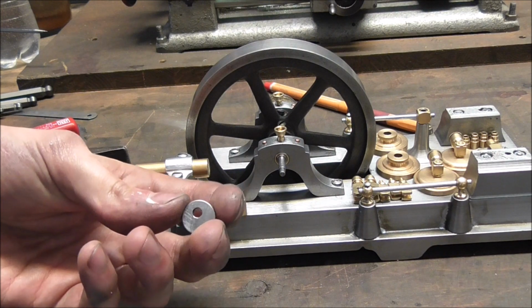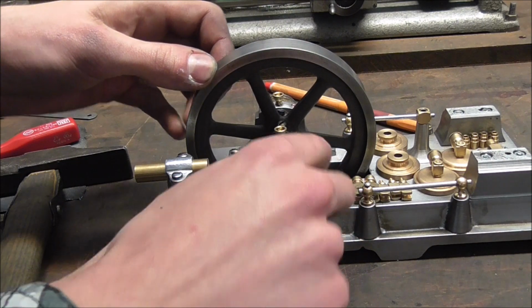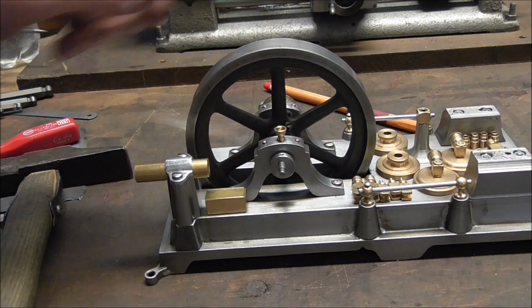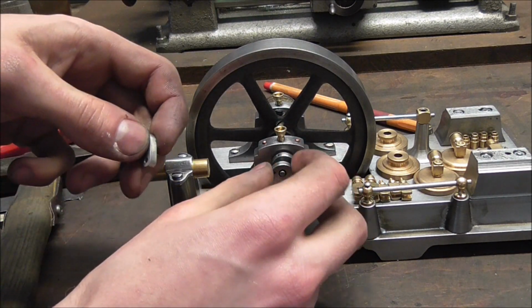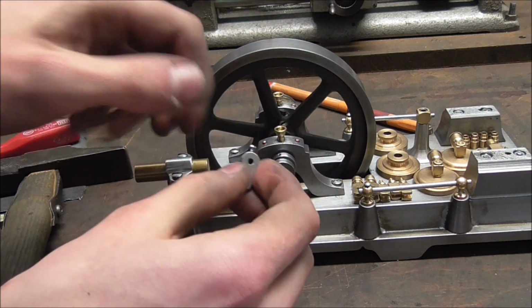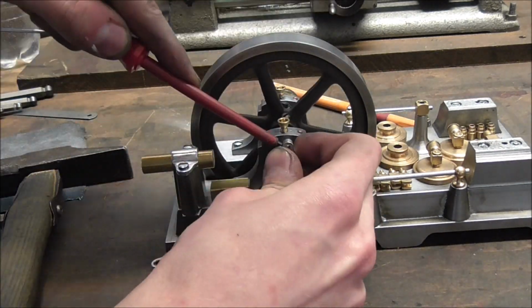First comes the water pump eccentric. Now I don't have any grub screws yet, as I said, but this is a rather tight fit on here. Nevertheless, we leave it like that for the moment until we get the grub screws. Same goes for the cranks here. They will of course not remain like that. I plan to use pointy grub screws on this one and drill a tiny divot into the shaft to just make sure that the cranks will never move on the crankshaft.